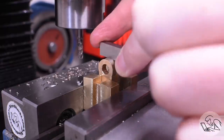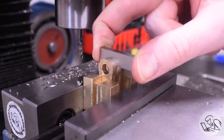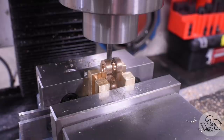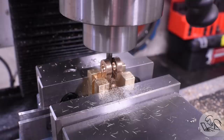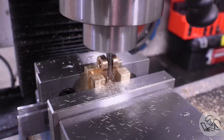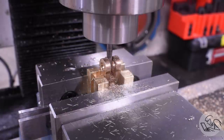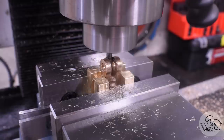Width-wise, a stack of gauge blocks tells me that end mill actually cut right on size, which is pleasantly surprising - they don't tend to do that when slot cutting. That means I just have to widen out each side a little bit to final dimension. I'm doing this in two passes, one above the other, because I don't have quite enough depth of flutes on this mill to do it all at once. But that's just as well, because you get less deflection this way - so you end up with a better finish and better dimension.